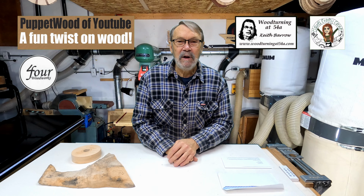All right, now for today's project, you might remember the last one I did was a maple burl, and it was a long piece, and I cut this part off of it. And I really hate to waste wood, and if this is as beautiful as what was in that burl, or even close, I really don't want to waste it. So I'm going to take this glue block, glue it on there with hot glue, then I can set it flat on the table of my table saw, knock some of these corners off, and we'll see what I can turn out of this.